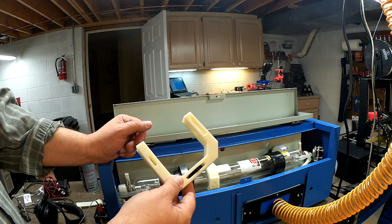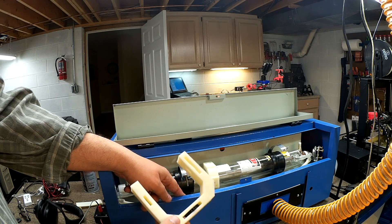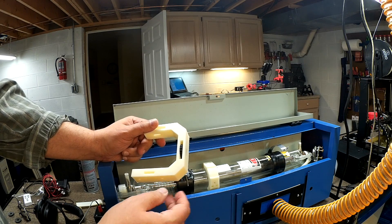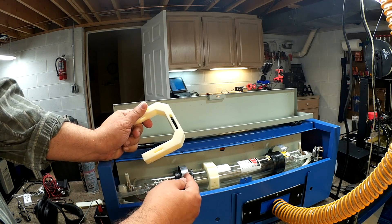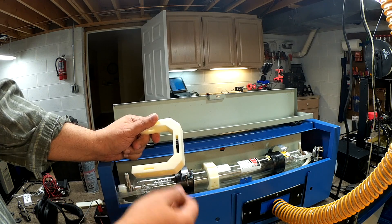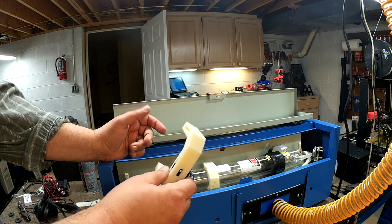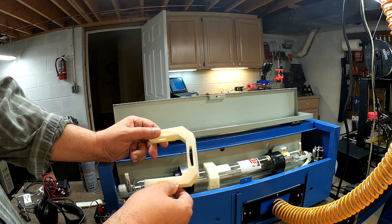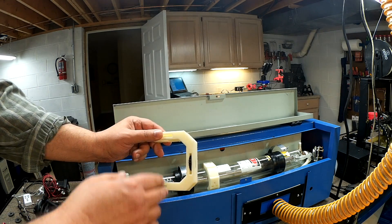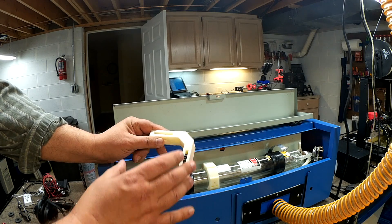This is sort of the kickoff, and I need to take this apart to get the saddle blocks out so I can measure them. I want to make the bottom piece match the saddle blocks — they rise past that lip and set the width. If I design the new piece to the saddle block dimensions and bolt-hole positions, I can just slip it in and bolt in the replacement. I also need to measure the saddle block height to ensure I can drop the tube far enough down to get dead center alignment.